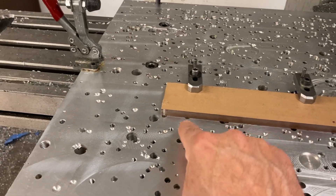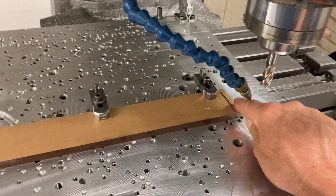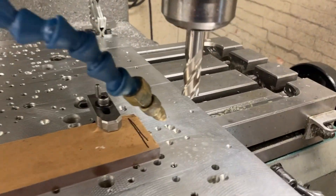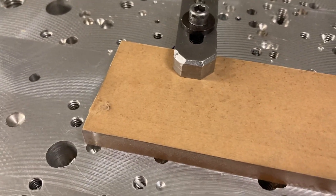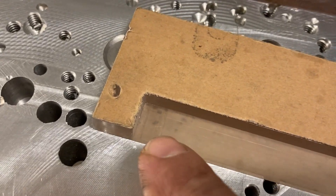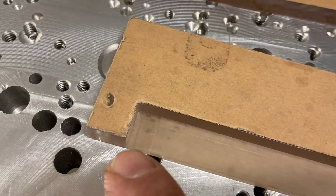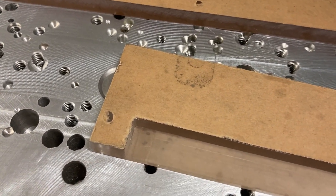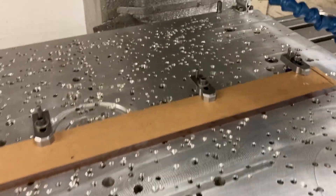Tool comes in, takes a rough cut, comes this way, walks off the part, rapids down the other end, goes back in, takes another rough cut, comes down the piece this way, walks off the part, rapids back, goes in, takes the finish pass, and then off. But because that's a half inch tool, that's going to leave you a quarter inch radius on the inside corner. I need a 0.062 radius on that inside corner. So after this is all done and finished, I'm going to stick a one-eighth end mill in. I just program it to go right here, come in over here, one-eighth, go in, take some of the radius out, walk off, come back over, go back in, take the remaining part of the radius out. The one-eighth tool gives me my 0.062 radius in the corner.